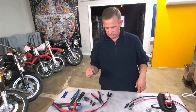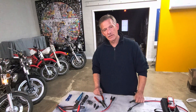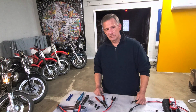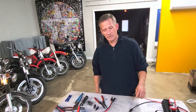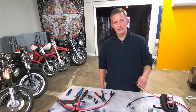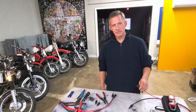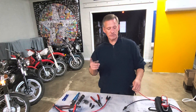That's why it'll keep dropping out — you'll still measure voltage, but it won't work. And that's bad news because the best-case scenario is everything's connected nice and solidly. The second-best scenario is it's connected very poorly with a big gap. But if there's just a little connection, that spells potential fire or melting.